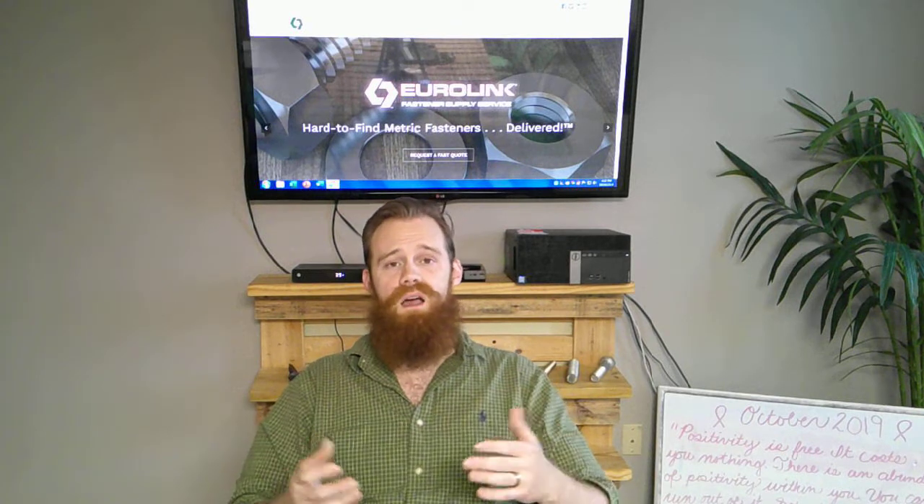That's the main difference. The only other difference is that ISO-7092, for whatever reason, omitted a few sizes: the M1, the M1.3, and the M1.5. Those three sizes were omitted from the ISO-7092. So ISO-7092s are available generally from stock in the range of M1.6 to M36, inclusive.